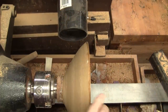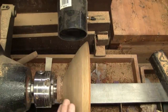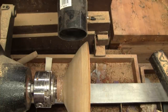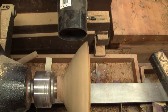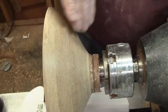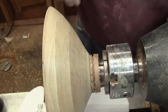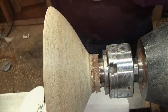This is what it looks like when that sealer and slurry mix dries, and it looks like it's covered all the cracks — hopefully it went down in them. I'm going to go ahead and sand it with 120 grit. I've got my dust collector right here because it will be pretty dusty, and it has been sanding pretty easy. It's about 350 RPM. This really sanded up nice and that slurry I made by sanding with the sealer has filled in all the pores and little cracks. I'm going to keep this fairly simple — I've got that sealer on it and I'm going to use Axe Abrasive Paste.